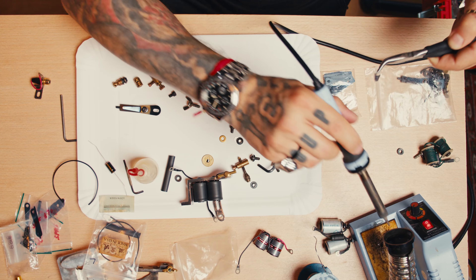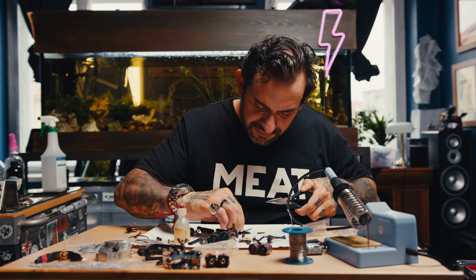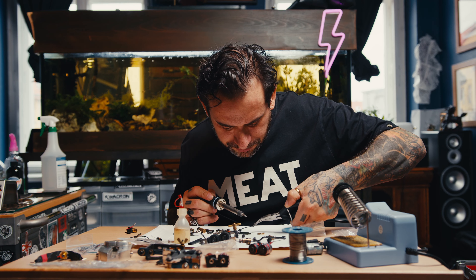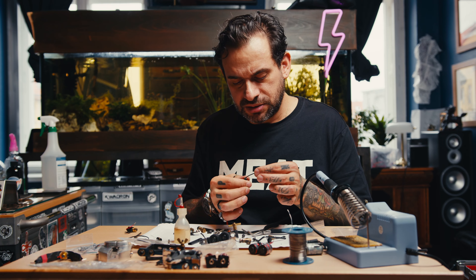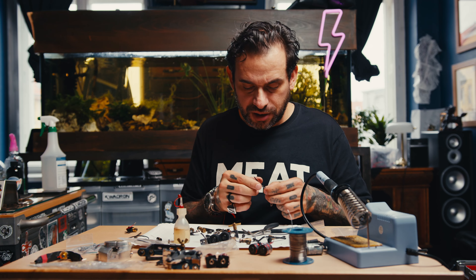I don't believe many of you will need this — it's just extra information, extra knowledge. Unfortunately people don't use these coil machines much anymore, but at the end of the day it's nice to have. So then I make the solder softer to get them together, then just roll it. Here we have the first one done — nice, clean, and neat. Then you have this shrink wrap around the cable, which you hit with a heating gun, hair dryer, or lighter — it shrinks and protects the cable.